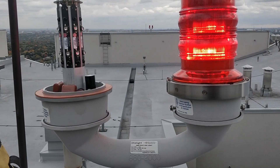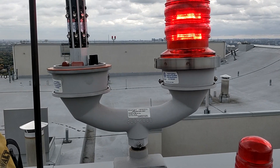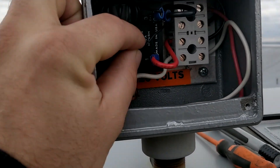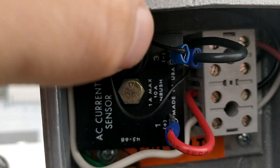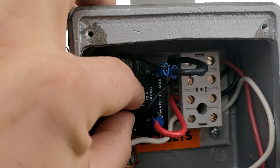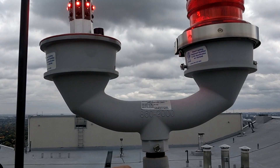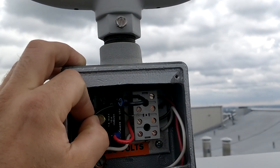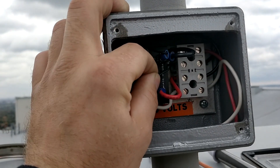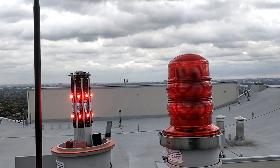It sends the signal through another wire and it goes to this light. To test this, I'll just remove this little wire — which, if you can see, is actually on that coil right there. It goes through the coil and senses the current of that light. As soon as I remove that little coil wire, this light goes on, and when I put it back — the relay kicked in, it shows there's no current flow, and the other light turns on.